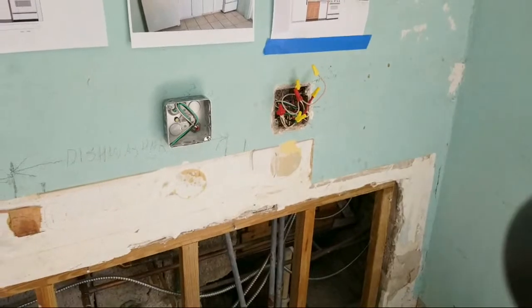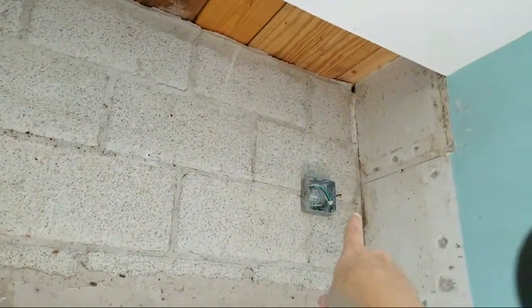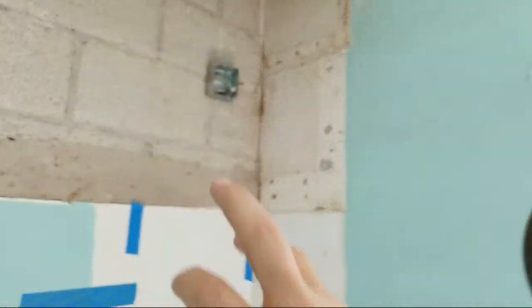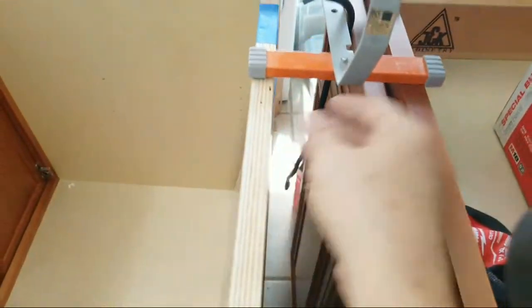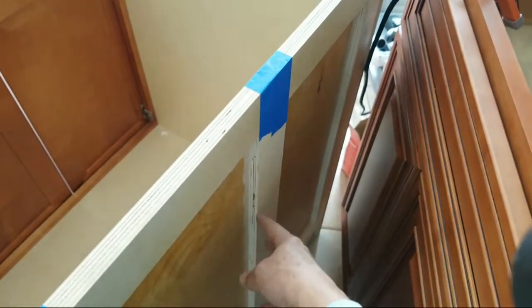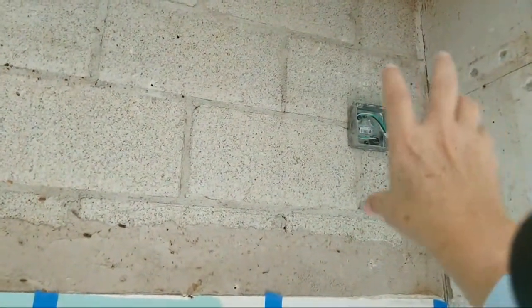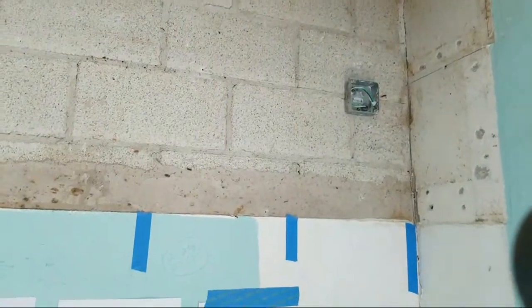Up here we calculated where on the wall we have to put our outlet for the microwave oven, which will be in that cabinet that goes right there. Not only do you have to figure out where the cabinet is, but when you look at the back of your cabinets you have to know where your panels are. You have to know where there are keepouts — I don't want to be drilling a big square hole through one of those. So you pick a spot where you know there's a panel on the back of the cabinet, right in the middle, not touching any of the wood bracing. That's an oops a lot of people run into.